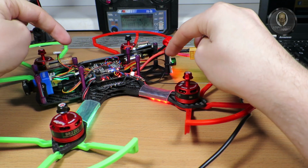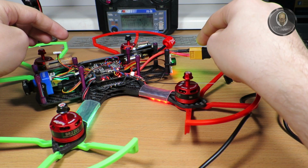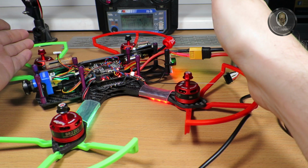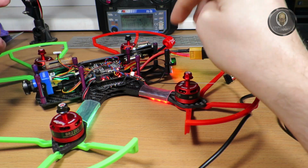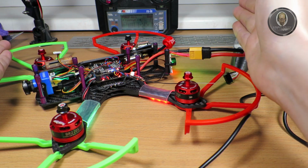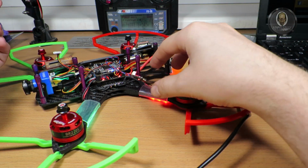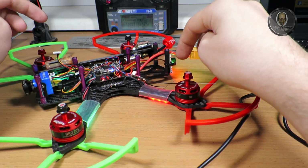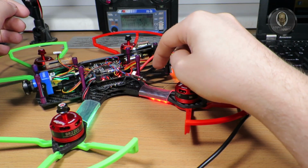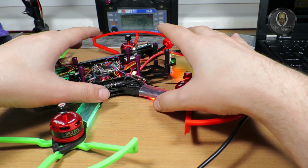I did not check the full range. Also I need to change the failsafe, because it's set to 150 meters, I think, and then it will return to me. I will change that, maybe to 200, because I'm not flying too far from the drone, and when the weather lets me, I will test it out. So now I will just turn off the camera and work with that, and you will see how it's working outside with all the telemetry.